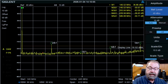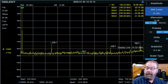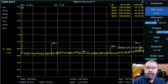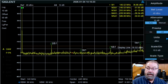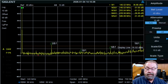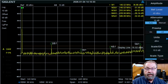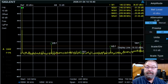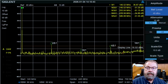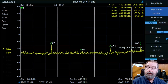The four numbers below it are where our harmonics are and how many dBm they are below the fundamental frequency of 146.52. You can see they are all more than 43 dB below the fundamental, which is a good thing. But if you look at the red line about halfway down the screen, harmonics number 2 and number 5 are poaching the red line — that is more than 25 microwatts, or minus 16.02 dBm. So this radio is a fail. It does not meet CFR 47 Part 97.307(e).